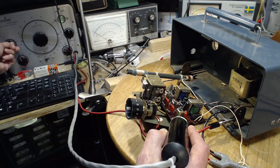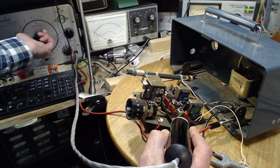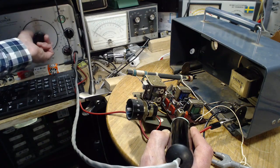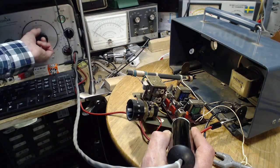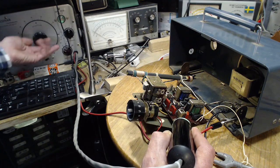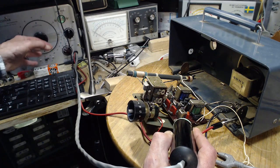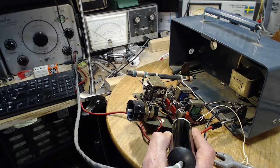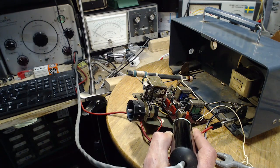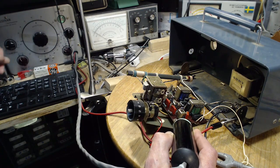Okay, well, what do you think of that? Now that to me sounds much cleaner, doesn't it? Let's tune a little bit. Something kind of funny going on with this radio here. So we should only be able to hear it just right in this area, and we shouldn't really hear it down here, but I'm not going to worry about that. Sounds like it's not actually 455. So we have a nice signal here. Sure sounds like a nice signal on RF, but the audio version of this, which I can get on here pretty easy,